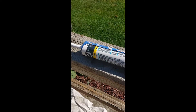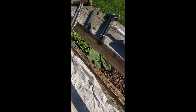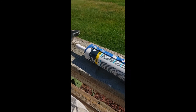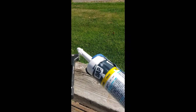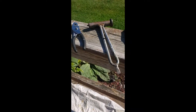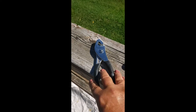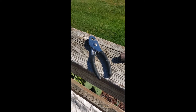Of course you have to have a screwdriver in case there's anything you want to take off the window. I always have this - it's not really a putty knife but you can use it; I don't know where my big putty knife went, someone borrowed it and didn't put it back. I have this big old brush because that's what I use to dust the windows off. This is what I use to glaze the windows - I used to use old-fashioned glazing, but a friend who owns a window business uses this and I really like it. I also have a couple scrapers, a handmade tool that opens cans, and some pliers for pulling nails out of the window.